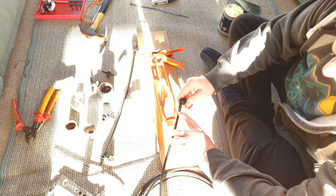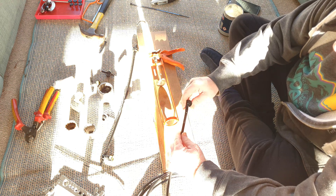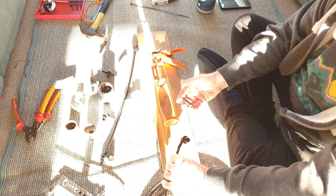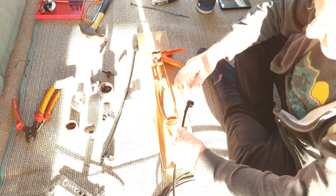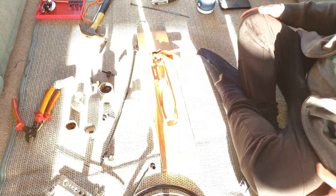In this instance I managed to get a little kink in the pipe, but that isn't going to bother it at all because we're only using this for a vacuum pipe — as long as it's solid, that's fine. That would probably not be a problem even for a fuel pipe, but if it was a fuel pipe I'd probably do that piece again. You might get a few kinks on a few goes, but all you're doing is using up a little bit of pipe — still probably an awful lot better than spending several hundred pounds on the original equipment spare parts.